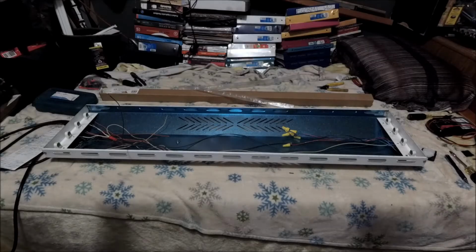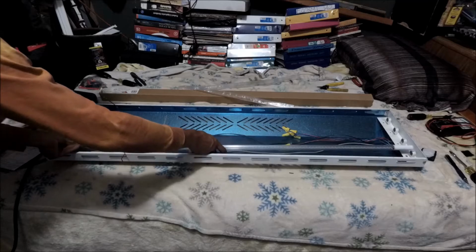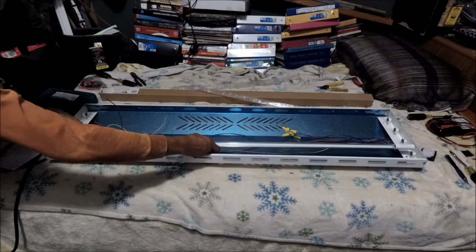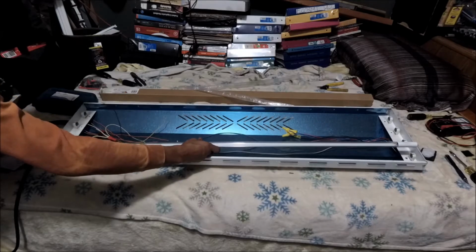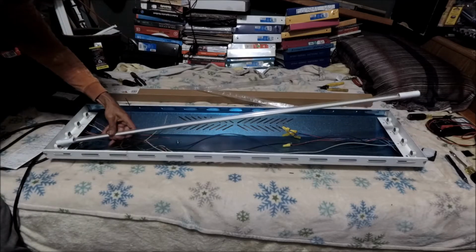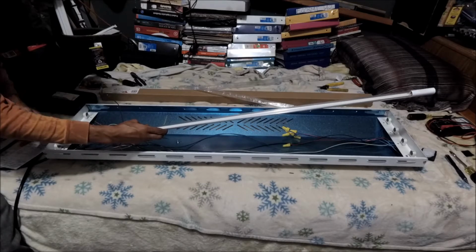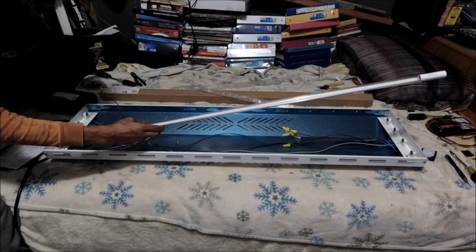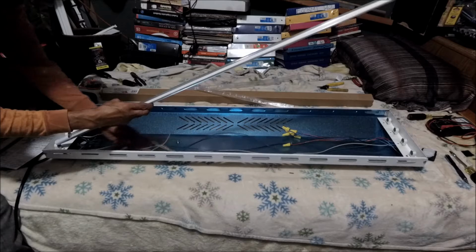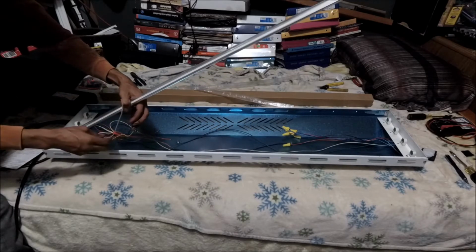Alright, so look, when you insert, that's the way it's going to go in, but I have to turn it that way, right? So now my neutrals have to be on the bottom, okay? And if you're facing this way, it has to be on my right, and my hot, my live, my line, has to be on top, on my left. So that's how I'm going to wire the two conductors on each individual tombstone. So that's how I'm going to determine what is what.